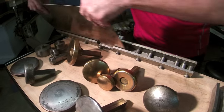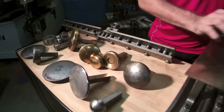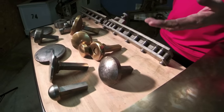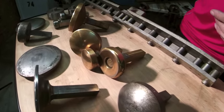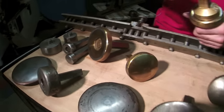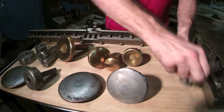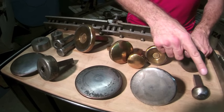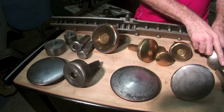to run sheet through to do cutting, shearing, beading, all kinds of operations, anything embossing that requires a repeated line. Or you can do these doming tools. So you got a female and a male. You can do raising with two male tools, which does wonderful work hardening, by the way.